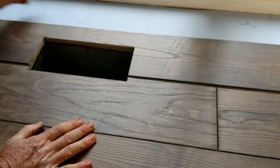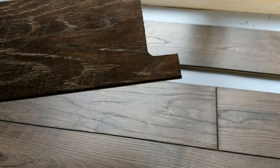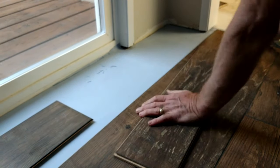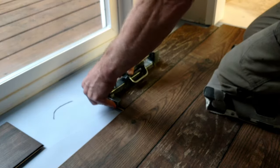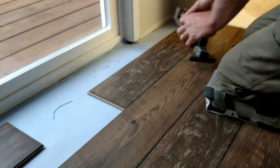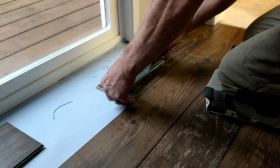The dry fit looks good. Now this is so cool and easy — it really bugs me when I see a little square hole from an overcut where the jamb and the casing come together. I actually developed this technique when I had to cut around a lot of bullnose sheetrock corners — I just stopped my cut back a little further to get a larger radius. I prefer this method of tapping the piece into position under the trim as opposed to removing the rib and gluing them together, but sometimes you still will have to use glue.